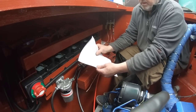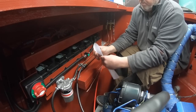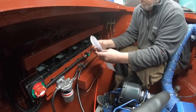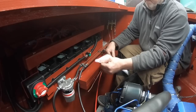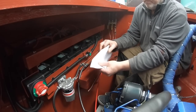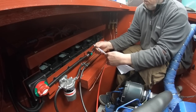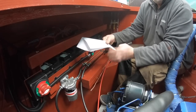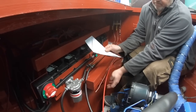So if you get a bit of paper, fold it. That gives you 45 degrees, obviously. So, and then if you fold that again, that's going to give you 22 and a half degrees. So that'll be your angle that your fuel pump needs to sit at. So if I put that line there on the bottom of there,